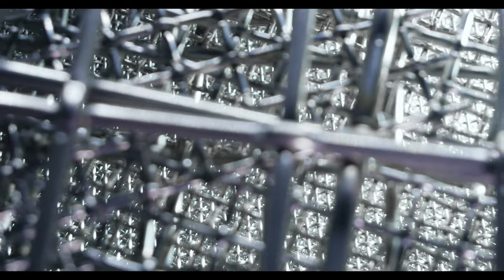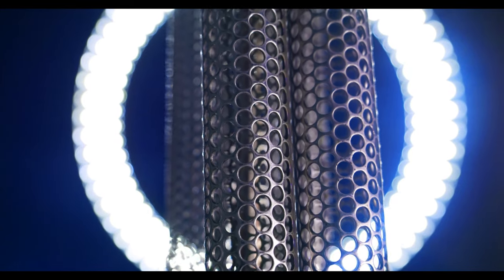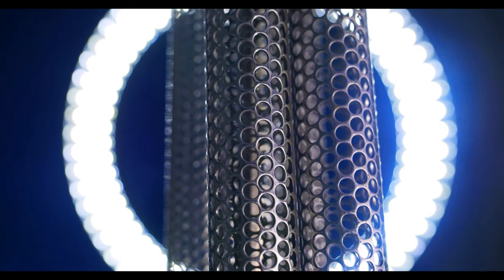Since a flat sheet is easier to blind as the open area is reduced, perforated plate is typically less effective in the smaller pore sizes. In contrast, woven wire filter mesh can normally provide a smaller cut point with more throughput. It should also be noted that perforated plate filters aren't as closely regulated as mesh filters. This can make it challenging to implement perforated plate in applications that call for heavily regulated equipment, such as sanitary pipe system filtration.